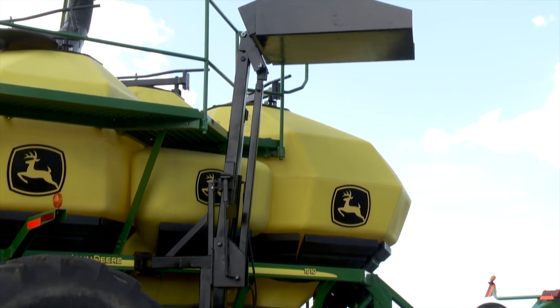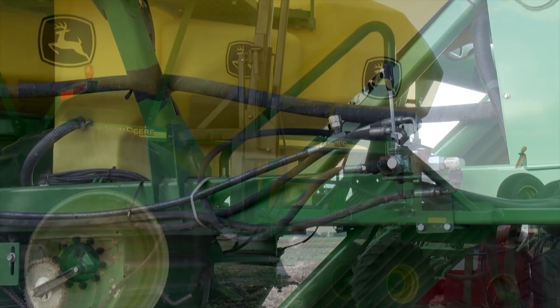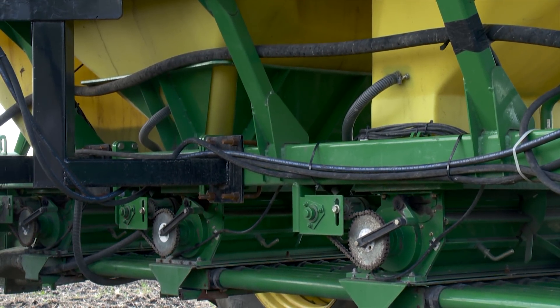Along with each loader, Layton includes all the necessary hydraulic components. All fittings are provided, and you tie into the hydraulics via a splitter on the line that runs the fan and the auger — you T off of that. This allows you to use the bag lift, take it up, split back, and then start putting your fertilizer in while dumping your seed, saving time in the field.